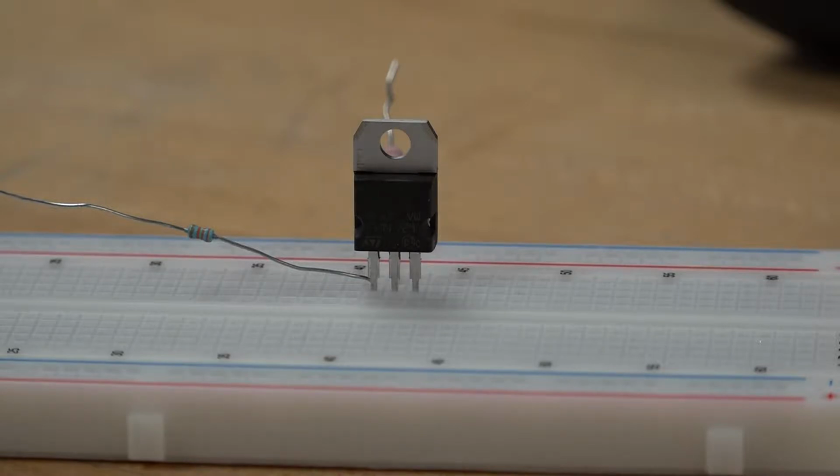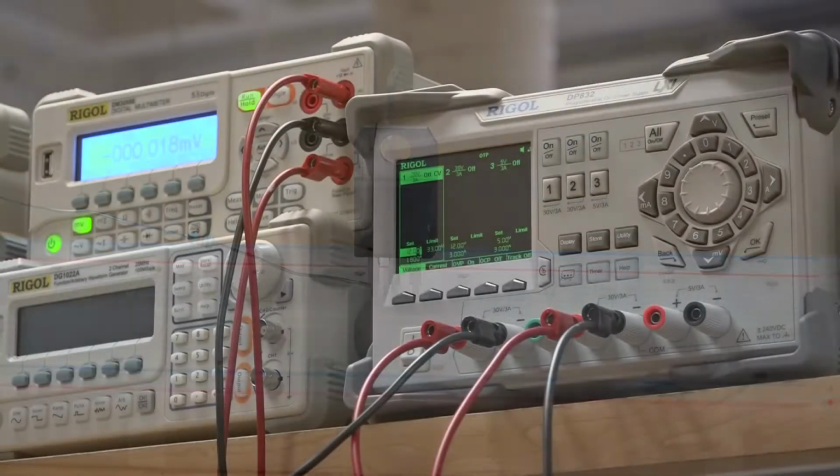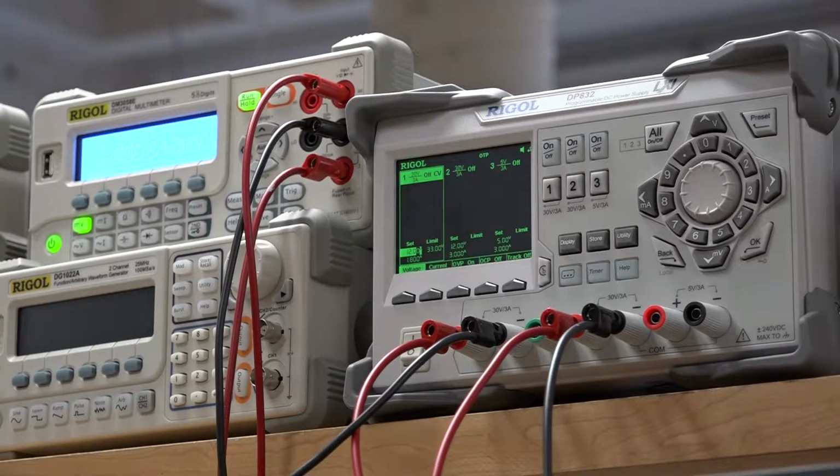Then we need to connect our circuit to the power supply. Actually, we want to bias the base and collector, and put the multimeter in the circuit so that we can measure the current passing through the emitter and the voltage drop across the collector and emitter. So we're going to have the VI characteristic of this.